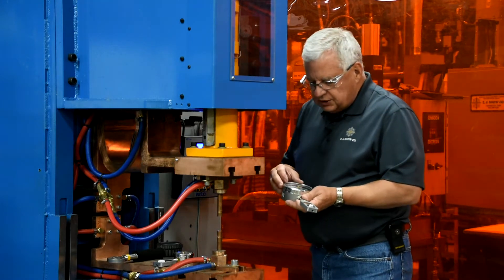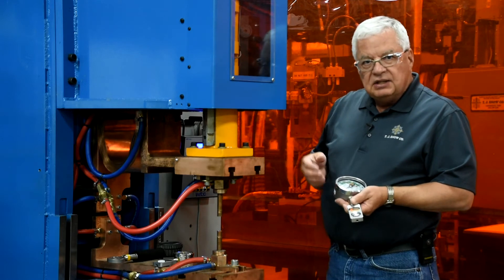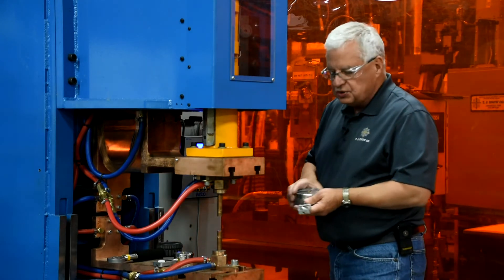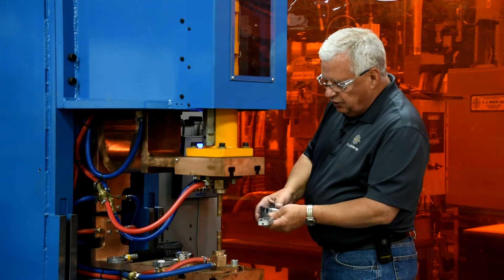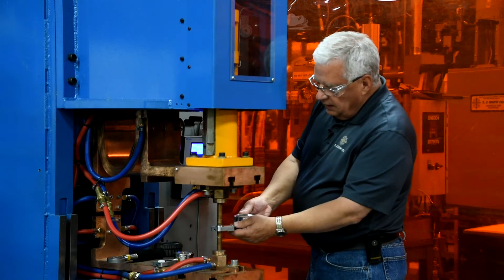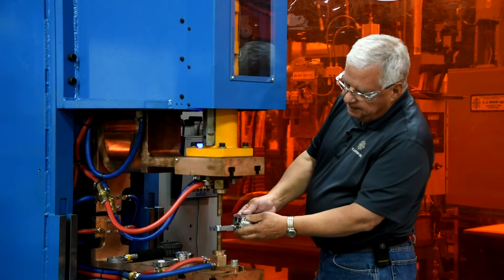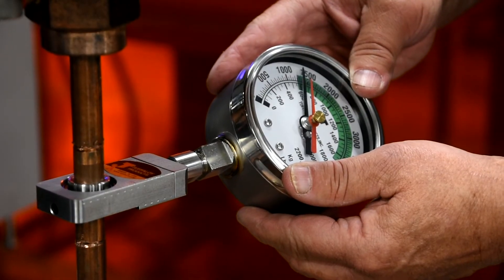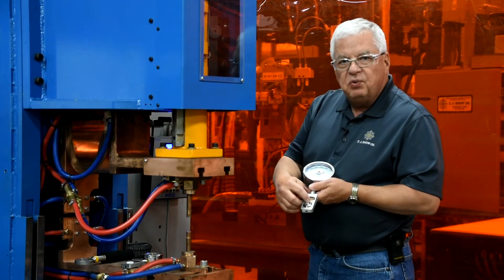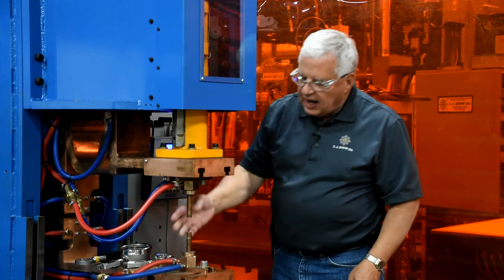You can see it moved that red needle up to show the force on our electrodes. We can see the force moved up into our green arc. What I like to do is take three readings to make sure I'm hitting the same spot and can average the force across those readings. I'll move the arrow back down to the needle again and see what force it comes up to — it came up to the same as the last one. For my third reading I'll repeat that, and you can see this one was a little bit higher, which is probably where I hit down on the load cell.